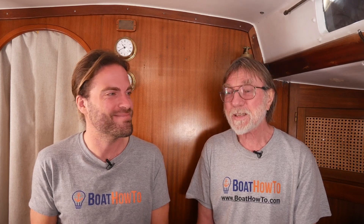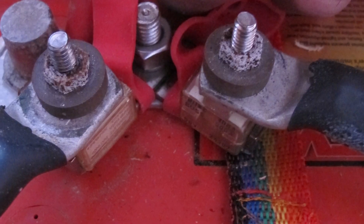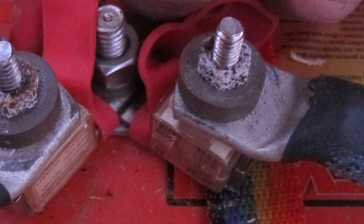I know it's horrible because they're expensive, but most of those terminals that you get in the auto parts store are tin-plated steel. The minute you screw down on it, you cut through the tin plating, and then you're in a marine environment — a salt atmosphere — and everything rusts, and then you've got a lousy connection.